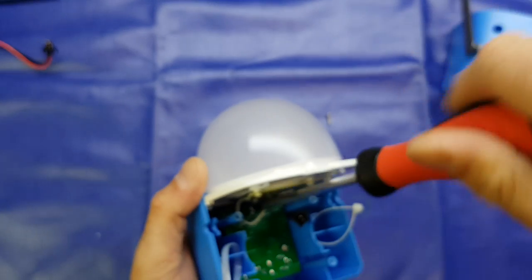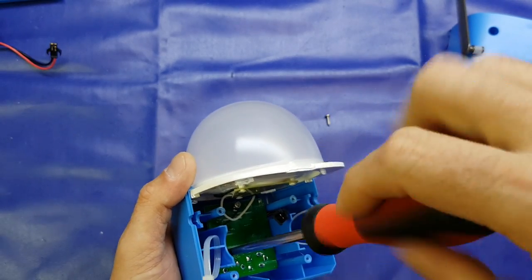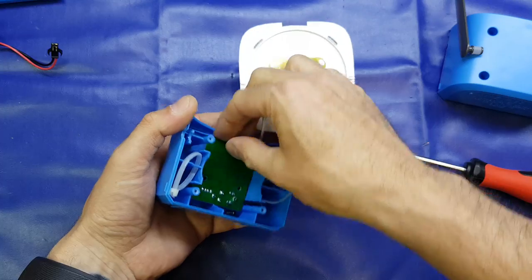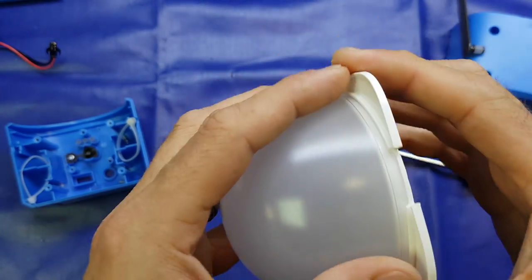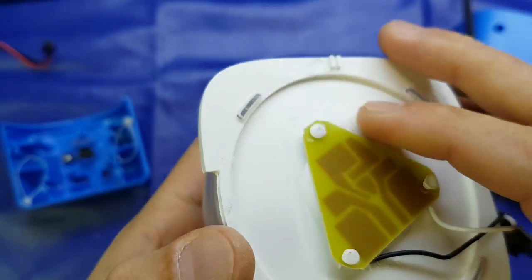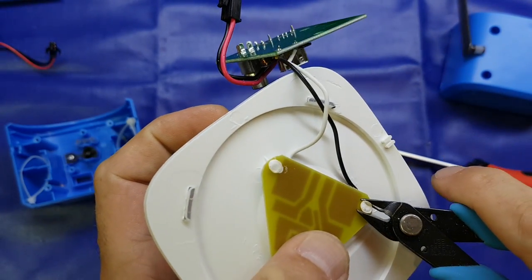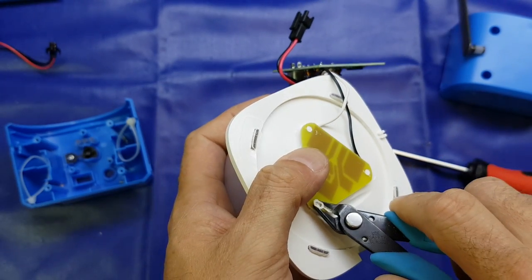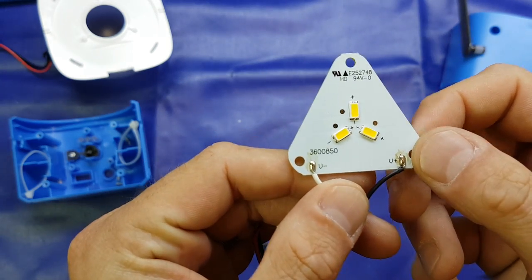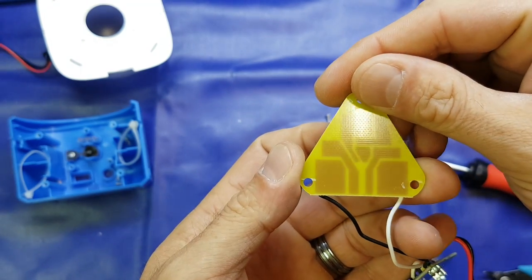Here's the business end — let's take this PCB out and have a look. Give it a little jiggle as you do. This dome looks like it's either glued or ultrasonically welded, so I don't think I'll be able to take that off. The LED is on heat sticks, so we'll just cut these — I can always glue them back on, and I don't imagine there'll be much heat generated. So there we go — just three LEDs. I need to sketch it out to check — negative goes to there, positive, negative... yeah, they're just in series.